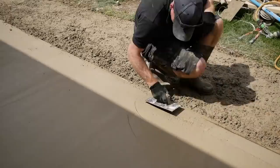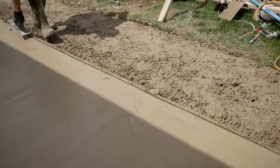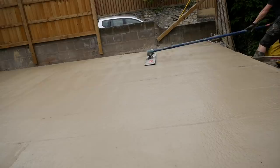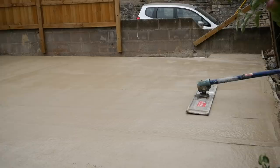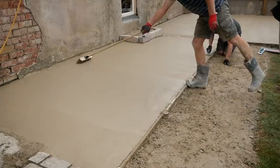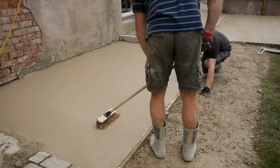A few hours later I was able to float that off. I hired a bull float, and then I was able to do a bit of troweling on the edge. I think the timings were just about okay - it was a pretty boiling hot day to be doing it. The main problem I had was I should have floated it off a bit better or troweled it off afterwards. I didn't get a power float or anything other than the bull float, and there was a period of time between doing that and then trying to trowel it by hand in the evening where I could have got a better finish. The outside path we just did a brushed finish for a bit more grip, and they've held up great over the years.